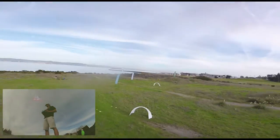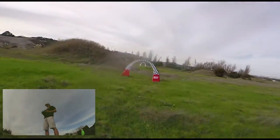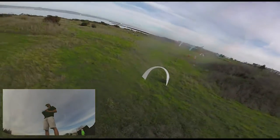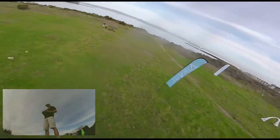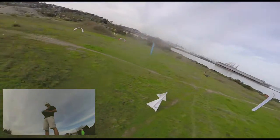Definitely, so this is the Betaflight defaults, and there's definitely a lot of prop wash that we're gonna need to tune out on these hard whip turns and split S's. P feels pretty good though on the straight line, not too much shaking, but I think we need to bump P up a little bit more to get the quad to fly more true. Yeah, we're gonna bump P up on all three. And then we'll bump D up quite a bit.